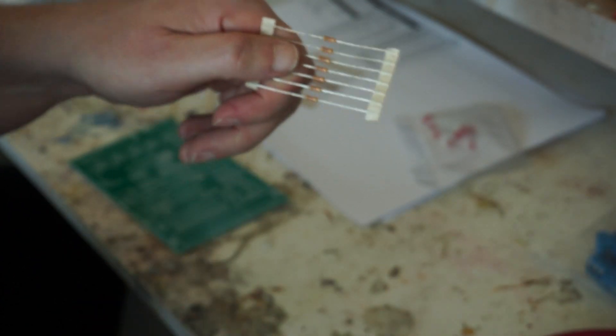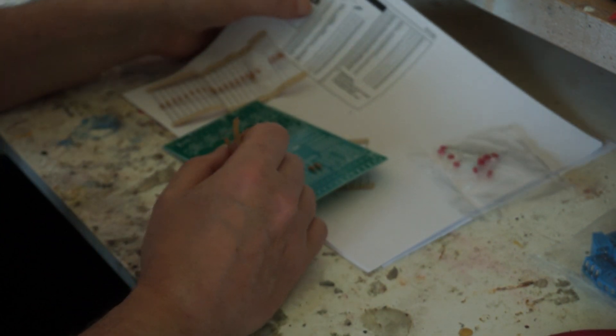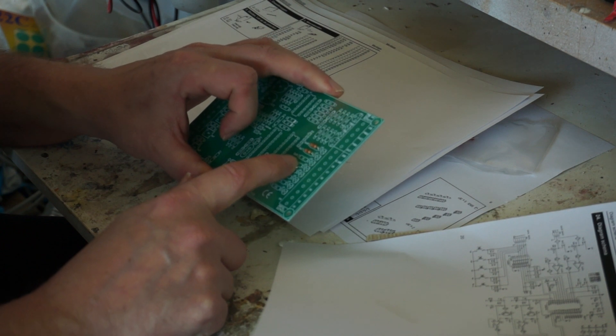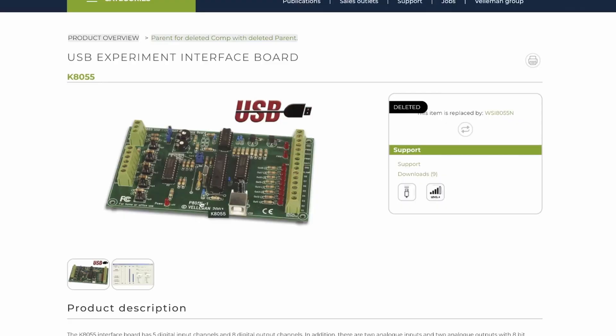You see it instantly — you know these are 1K, in series with the LED as a current limiting resistor. So I assumed R5 is also 1K, but here it says R5 is 10K. This makes no sense — these go to the LEDs, and 1K as a current limiting resistor is a bit high, but it would work. Then why would R5 suddenly be 10K? It should be 1K. And on the board I have a P8055-2, and these are 470 ohm resistors, which makes more sense for an LED. And there are definitely a lot fewer resistors.